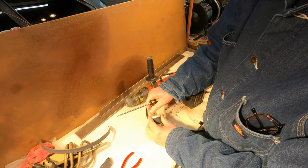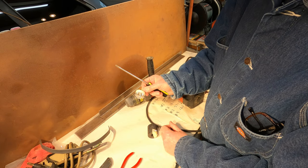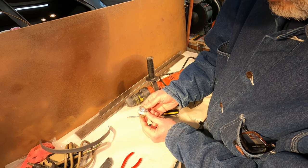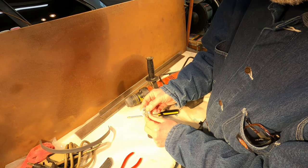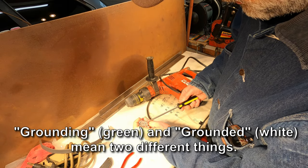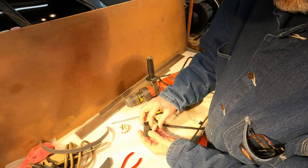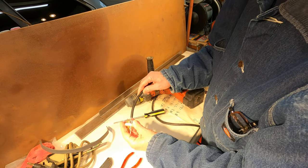The first thing you do is unscrew these ends — three screws on it and they're about one thread per inch. They just screw right in and out with a twist. On the inside there's three terminations: a green screw where you put the ground wire, a silver screw where you put the white wire, and a brass screw where you put the black wire. Make sure these are backed off enough so they fit in there without interfering. This cap has a cord grip so I just backed that out. Obviously you want to put the cord grip on first before you do anything else.